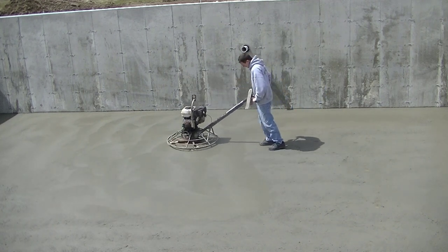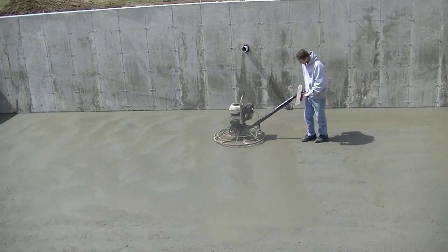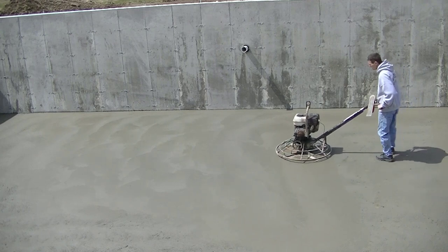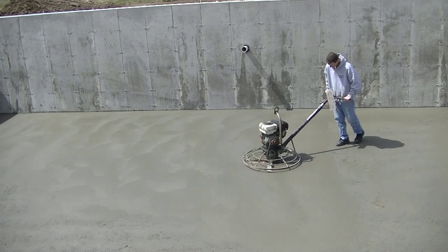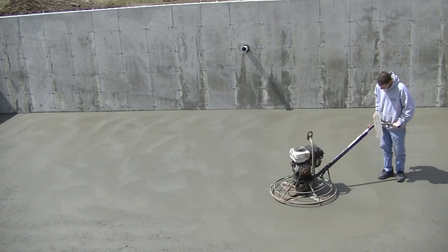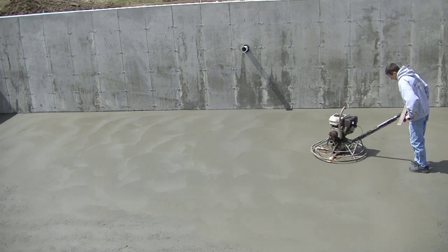You can see the hand trowel I use — I like the one with the square edge on the back and the rounded edge on the front, that's just my preference. My guys like the ones with both square edges on top and bottom. I'm not hitting all the way across the floor, just that one section that's hardest. I don't have to hit that other section yet — that's still plenty soft, I have plenty of time. However you have to go, you want to hit what's hardest and then work your way to the stuff that's softer. That's how you stay ahead of these floors.